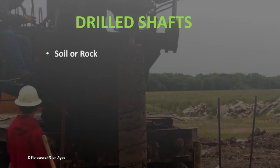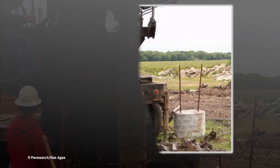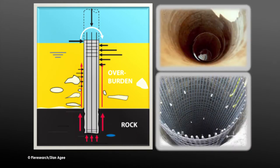Drilled shafts are created by excavating soil or rock using augers driven by mechanical or hydraulic torque. The shafts are drilled either dry, creating an open shaft in stiff soil or rock, or wet, using a slurry mix to keep shafts in loose soil open during drilling. In either case, the integrity of the shaft can be inspected prior to rebar placement and filling with concrete. After visual inspection, a dry method shaft is ready to receive a rebar cage. With the cage in place, the shaft is filled with concrete to create a pier that supports both vertical loads and lateral stresses.